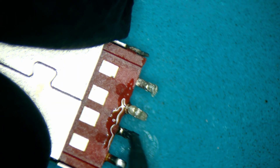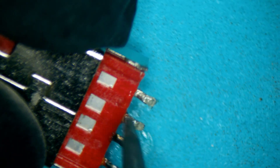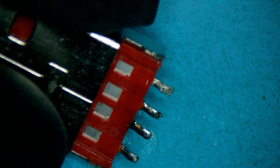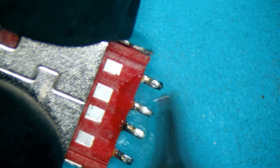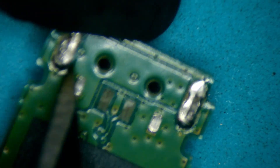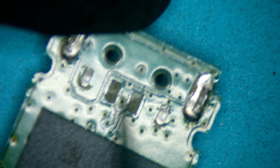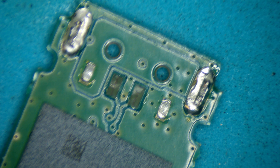We can go ahead and touch this one up. When you remove that, we also have to remove the middle one. Now look at that — it was like a perfect fit. So we remove that — both traces removed. Now we have a clean USB head to use. The sides are actually just hooks; they don't connect anywhere, but they make the USB more stable when you plug it in, because you don't want all that pressure causing it to rip just like this. So we need to clean this area up.